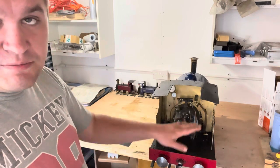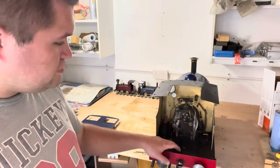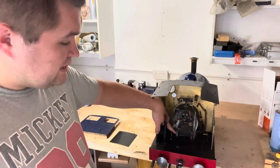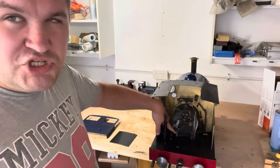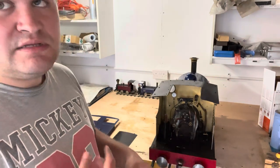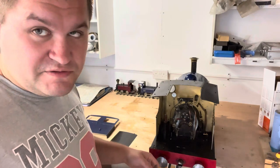So, in the back head here, the hand pump is under the floor, top of the cutout, she goes into a clack this side. That clack has been replaced. I'm dubious about it, but at the very least, the clack on top of the pump is holding. The pump doesn't feed back, which is great. How do I know it's not feeding back?